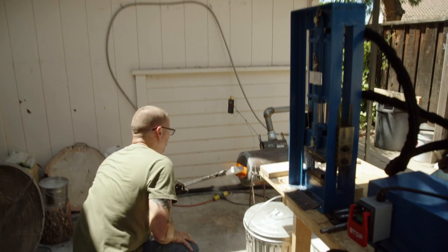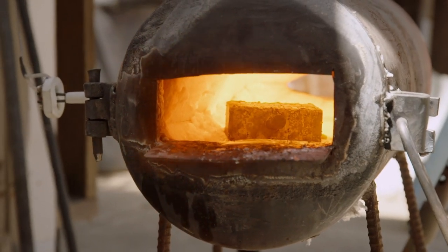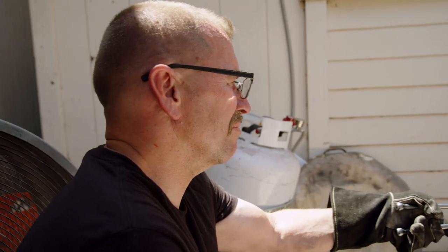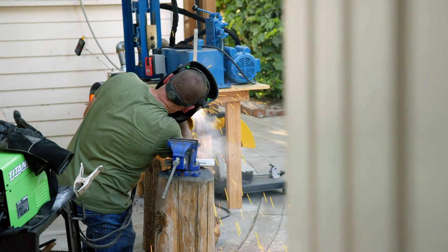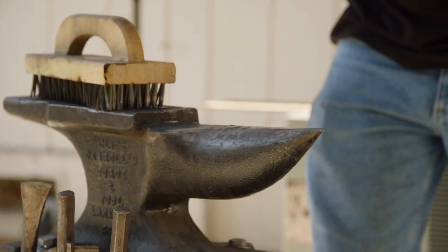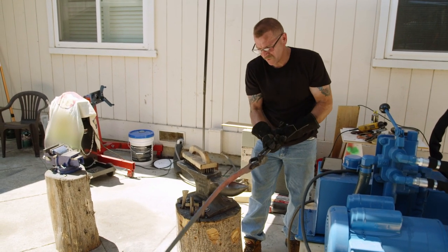My name is Robert Taylor. I'm from Brentwood, California. I'm a sergeant with the San Francisco Sheriff's Department. I took up bladesmithing because I'd like to watch Forged in Fire — it's something I really wanted to go further in, become an ABS Smith, maybe a Master Smith someday, because I love forging. I'm going to go 500 layers of Damascus on each side with a 1084 center core. We're going for our final forge weld. The 1084 will give it a stronger center. The place where I want it to bend will bend down, and then the tip will start bending up automatically as I hit it. I'm whacking it on the horn to get it to bend down — it's easier than using the hammer.